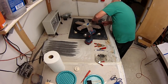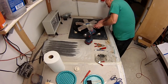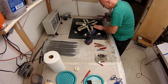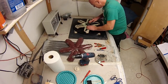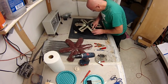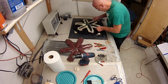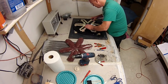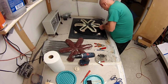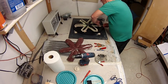I've already removed all the screws and I'm going around with a screwdriver to lightly release the top half of the mold. It takes a little work — when you build a proper mold where each half fits exactly 50% of the propeller, there are some tight angles. As you can see, it popped right off. The bottom half is harder to get off because of the pitch, so one of the processes I've learned is to use popsicle sticks to get each of the tips up and out. Here I'm inspecting the prop for any cavities or bubbles — this one came out virtually perfect with not even any pinholes.